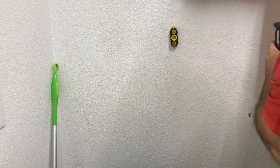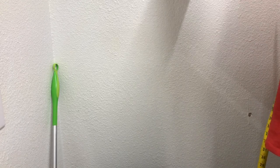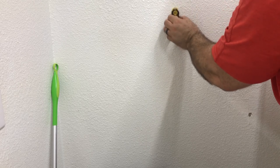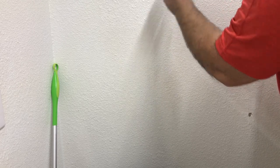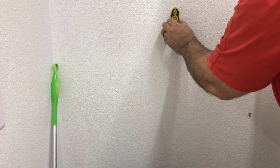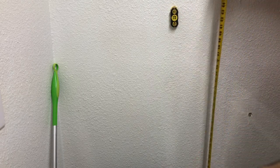There's a stud all the way down through here. You can tell by using a magnet — run it across the wall, and when you feel something stick, you know there are nails driven into a stud. So it's catching the nail, meaning it went into a stud. That's the first thing I do.